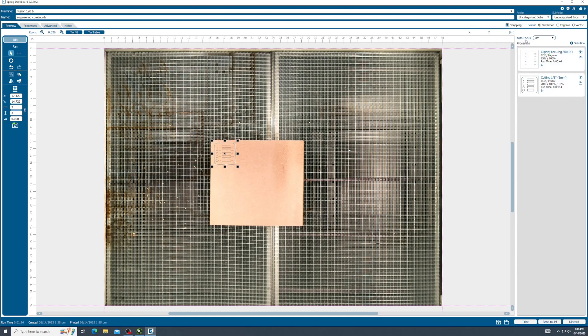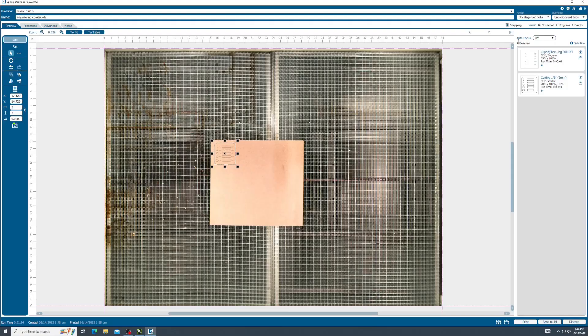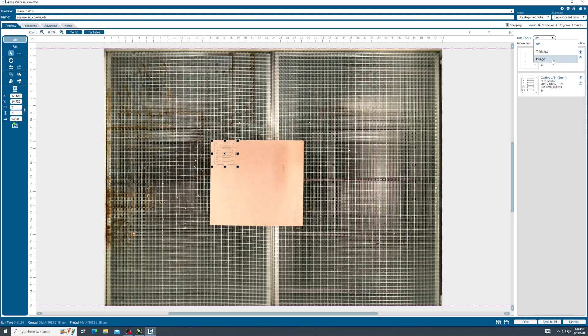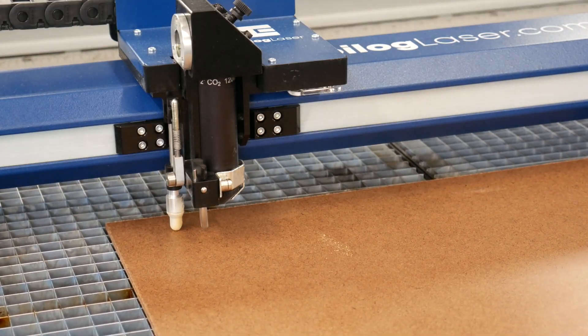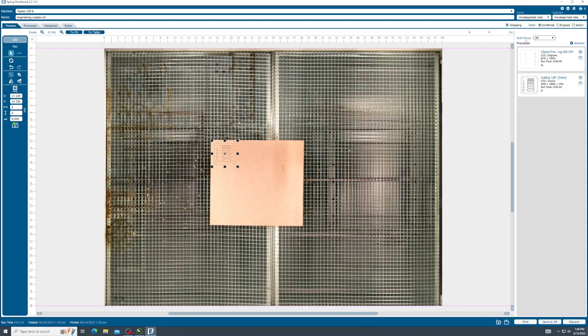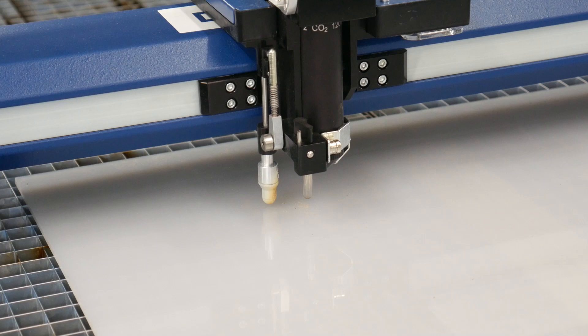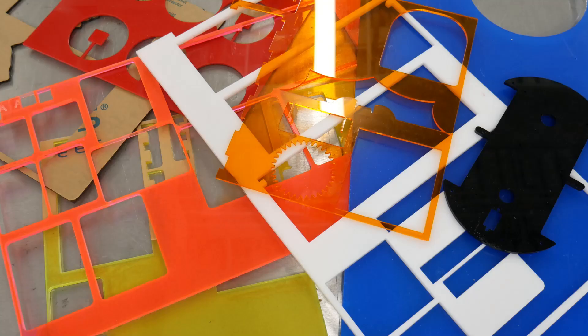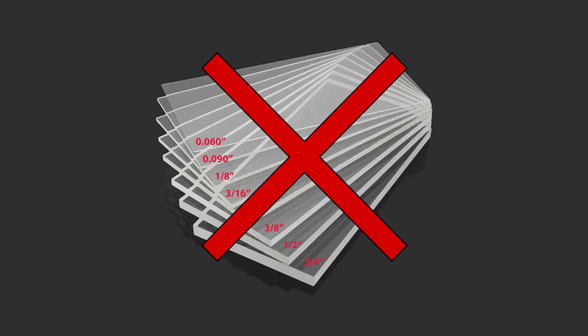Next, we have to specify how we will focus the laser. There are three options for autofocus: Off, Thickness, and Plunger. If you've been following along with this video, you may have already manually focused your material. If manual focus has already been performed, leave autofocus to Off. You will only need to focus the machine once if you do not change the material thickness. To turn on regular autofocus, select Plunger. When the job starts, it will probe the material and touch off to set the correct focus distance — this is the simplest method. The last option is Offset by Material Thickness. Using calipers set to inches, measure the thickness of your material and enter this value into the dialog box. The table will automatically move up or down so that the top of your material is the correct distance from the bottom of the focal lens. This method works best for engineered plastics that sit flat on the vector cutting table. Do not use assumed material thicknesses.